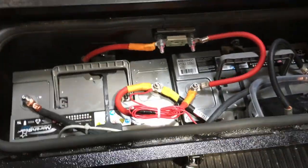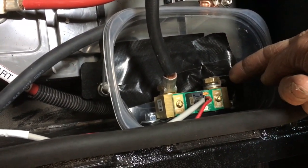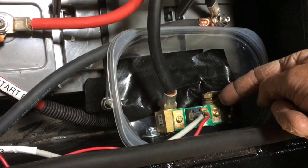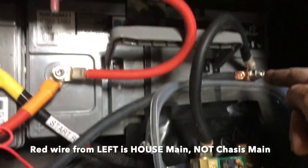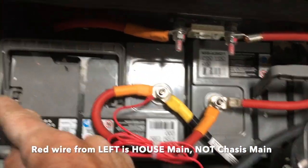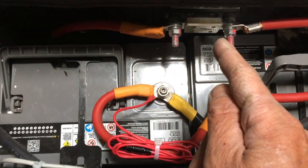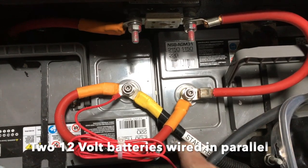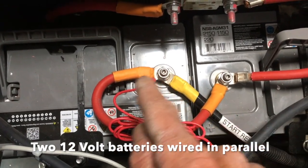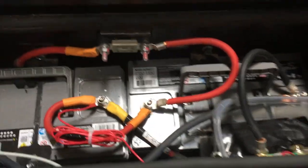About 40 minutes later, we have the wiring complete. It starts with the wires coming from the auxiliary line to the start battery and the chassis ground going to the voltage meter shunt. The main ground goes from that shunt to the negative battery, and that negative battery goes to the other negative battery. This is the main power for the chassis with a central fuse, and the auxiliary start line and parallel cable are connected. Pretty much we're ready to turn things on and see how it works.